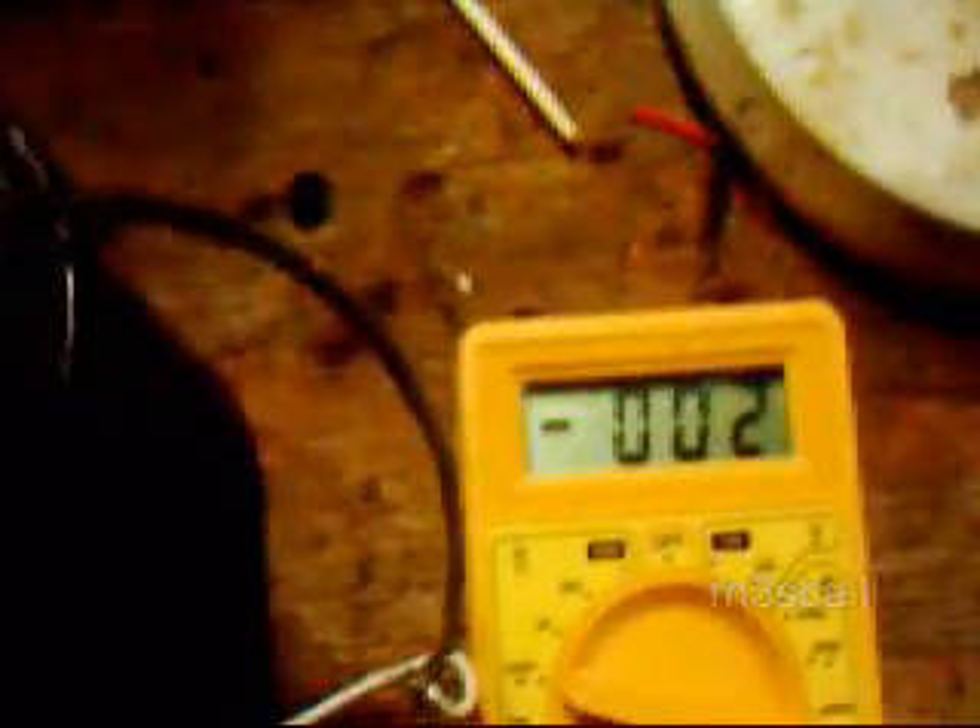Now the transmitter's off — here's our baseline sitting at minus 2 millivolts. You can see there is a little bit of a skip on the oscilloscope, but nothing like the signal we saw. The next step is to put a capacitance across here and tune it for maximum response on the oscilloscope, and then tune the transmitter, because I've got an adjustable frequency here which we haven't even touched.